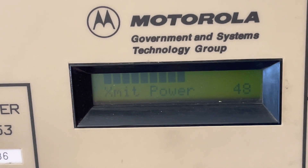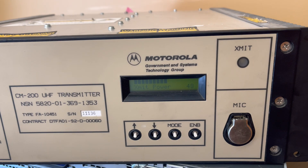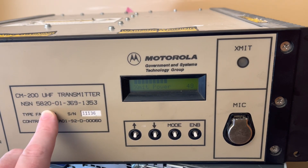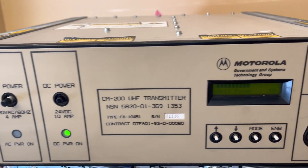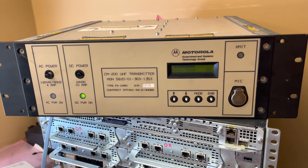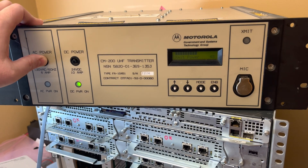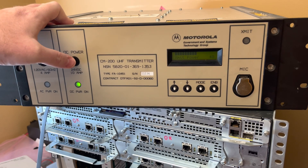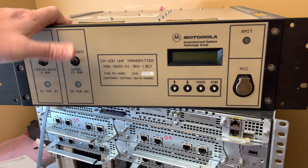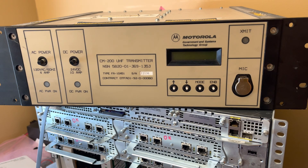The timeout is probably in seconds, and since it's air band it's going to be simplex — there's no way to do anything else. Zooming out here, you can see the switches. I did find some information on the contract number, which is printed right on the front — kind of neat. And these switches are something else — they're actual breakers. Let me power it off and flip it around so you can see the back end. I just have it hooked up to a little bench power supply.